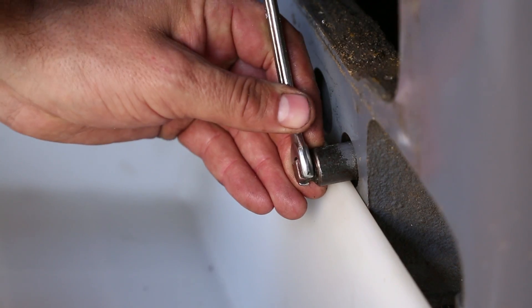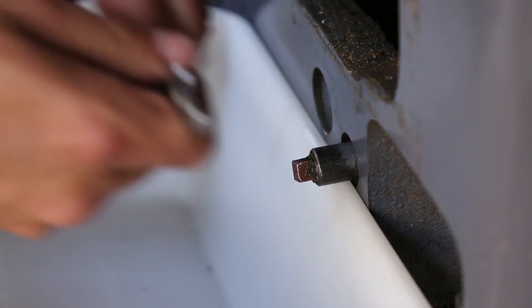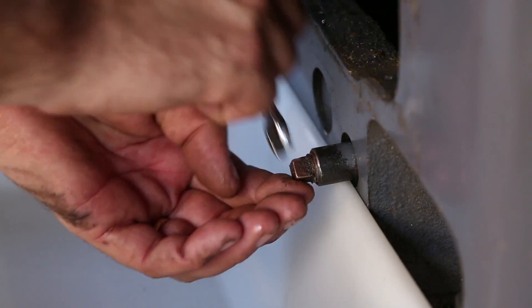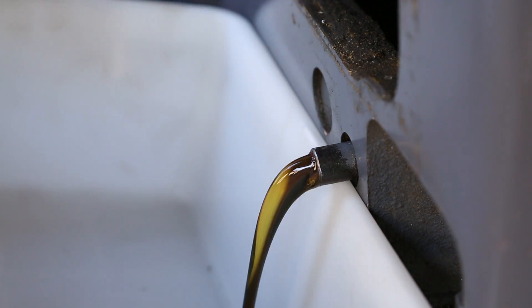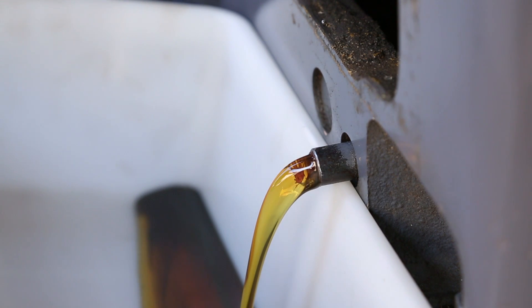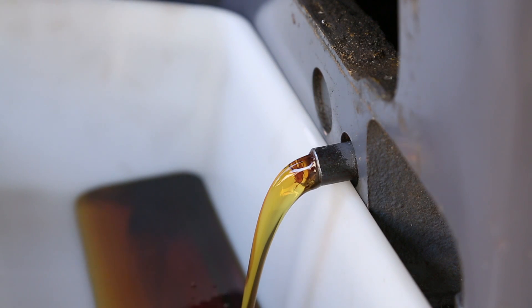To begin the oil change process I decided to start with the big main tank. It has a plug at the bottom which needed a bit of convincing to get off since it hadn't been removed probably since the day it was installed. The oil that came out was quite black initially and then quickly went clear, so I'm hopeful that that's not damage to the gear train but more just general age and settlement of particulates over time.